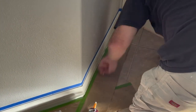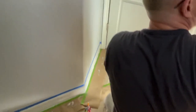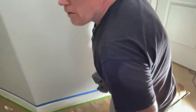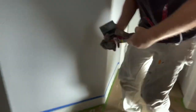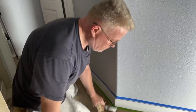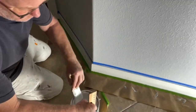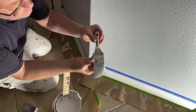There I go above and there I go below. I'm just pushing that clear caulking — even though it looks white right now, it dries clear — pushing it up against that corner where trim meets tape so that no paint gets beyond it. I have in my hand a nice clean cloth. If you get any paint on the floor, you can get it up. I'm using a putty knife just to scrape any gunk that might be on the trim. I have a little sanding square because I just want to scuff up the trim so that my new emerald urethane enamel sticks.